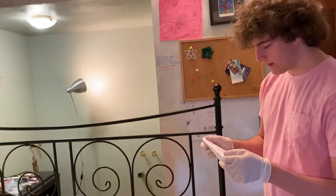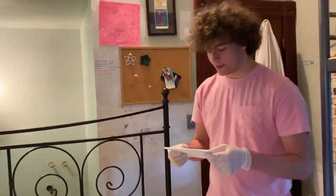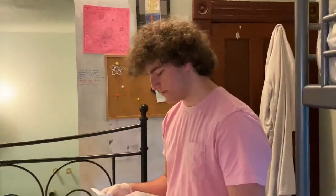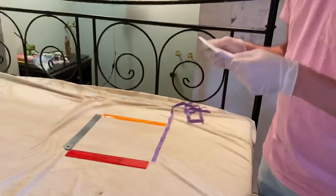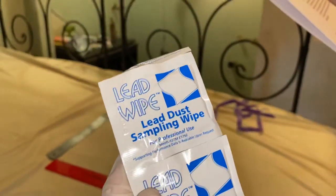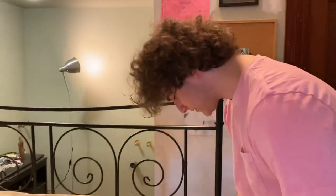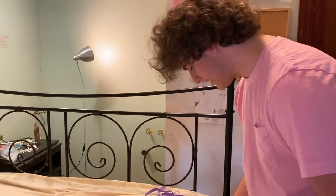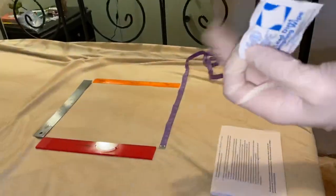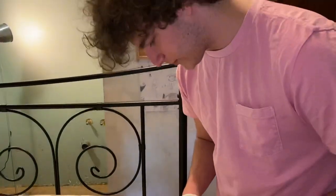Collect a sample of settled dust by following the sample collection procedures below. Number one: identify, without disturbing the dust or touching the area, the one square foot area to be sampled. Done. Two: tear open the provided wipe packet. These are called ghost wipes or lead wipes — lead dust sampling wipes. Tear off one because there's five of them. Tear open the provided wipe packet, being careful not to touch the wipe itself with bare hands. With a gloved hand, remove the wipe from the open packet and unfold. Handle the wipe only with gloved hands.